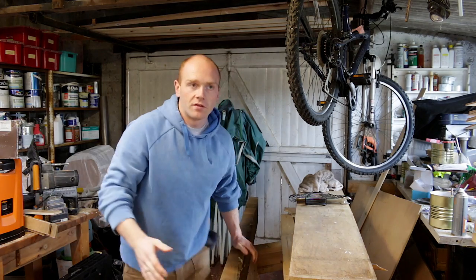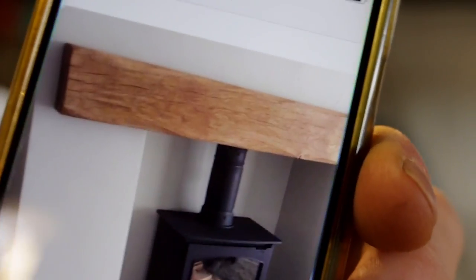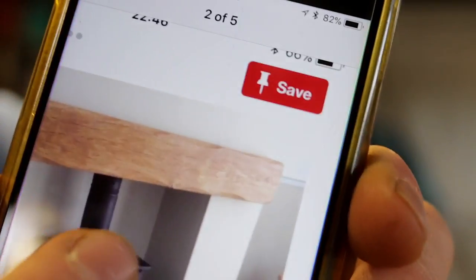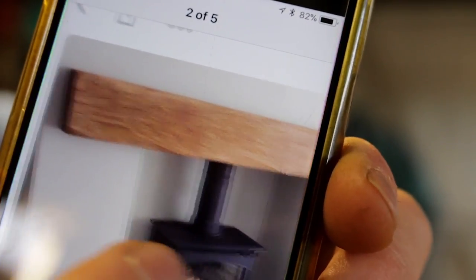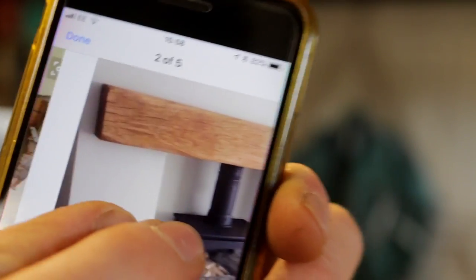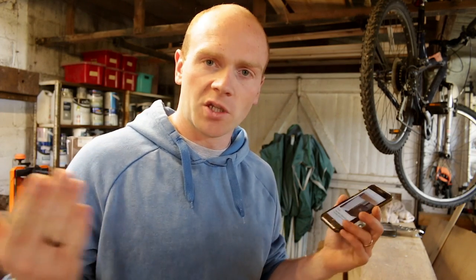The measurements are 1.2 metres or thereabouts, so we can pick the best section. Here's the photo he sent me — it's just a rustic oak beam, someone was selling something similar on eBay. It's pretty much the same idea: they're going to have the wood burner below and they want about 50mm of it showing beyond the plaster. So they're going to fit this 75mm thick oak onto the wall with some steel strap, then plaster flush to it, so it looks a bit more legit.